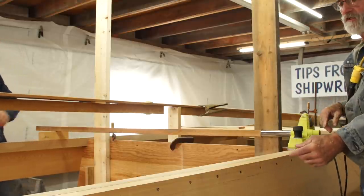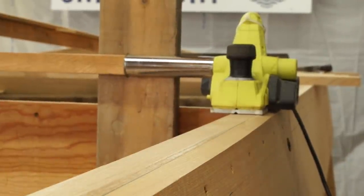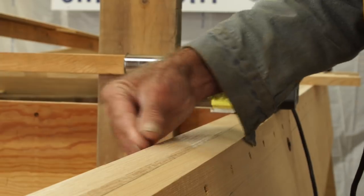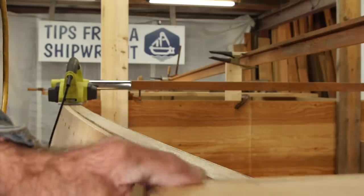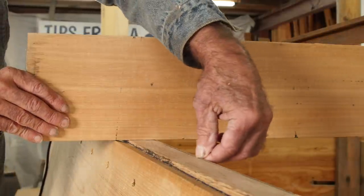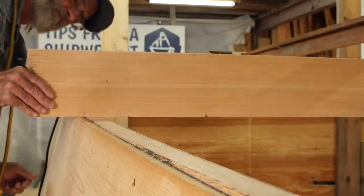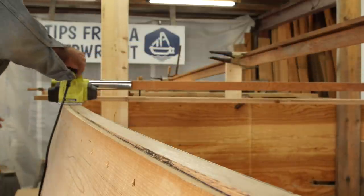Let's check it really quick. We're going to do a little bit of work on the other side - just going to stand it up on there. That bears down there really nice, real nice right in there. So that's pretty much it with the electric. We're going to stand the frames up and put a little ribband around them - that might tune this up a tiny bit. What I'm going to do is then go at it with a hand plane and just tune it up. Now I've moved over to the other side and it just needs a little bit of work over there. It's a little loose right over here and I've got a black magic marker line on there so that once I take that line off, I don't want to go much further than that.